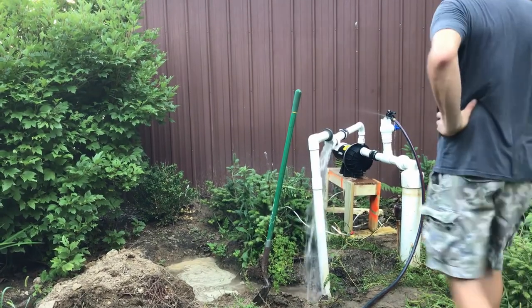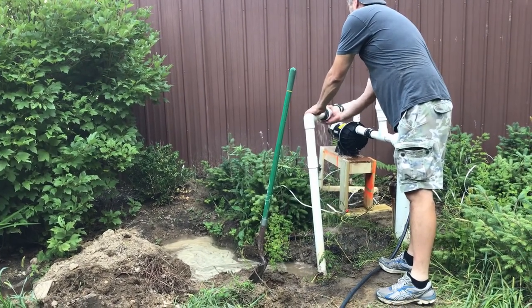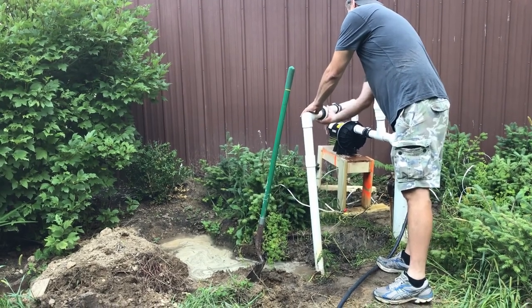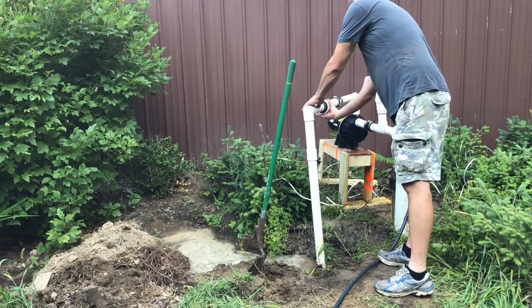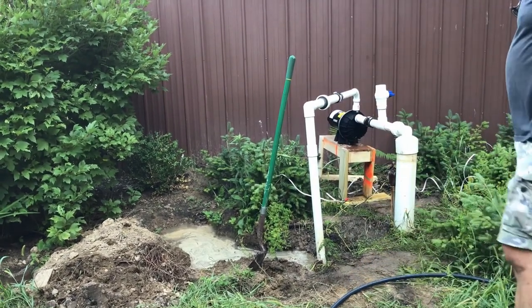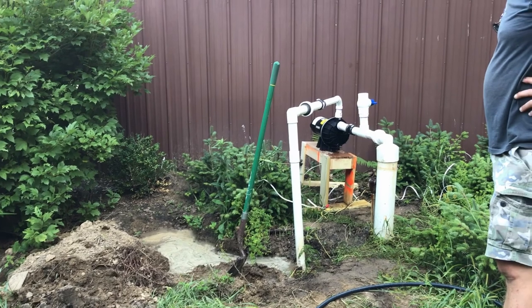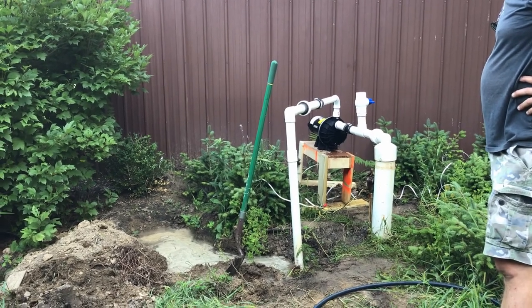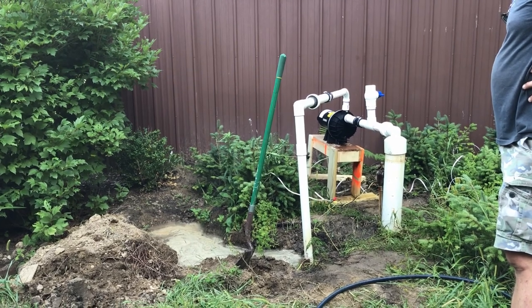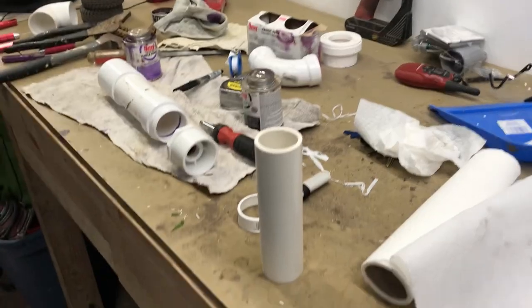My quick priming system works pretty well, however the pump still loses prime. It'll run for maybe 10 or 20 minutes, then you start to hear it cavitate, and then suddenly nothing. I can't even get out to diagnose the system because I can't keep this pump pumping water long enough to get to that point. I don't know why it's losing prime — it could be a multitude of things — but I don't really care right now. I just want to keep it running so I can figure out what's going on with everything downstream.